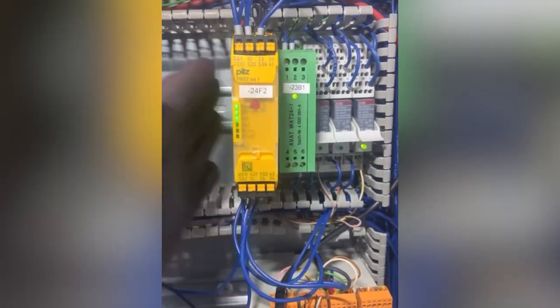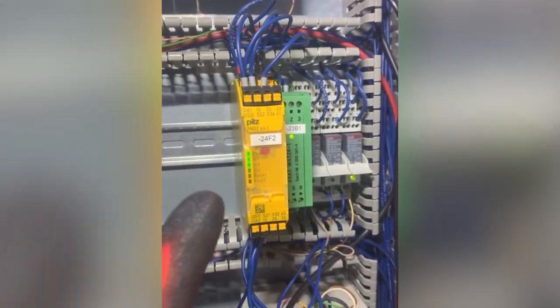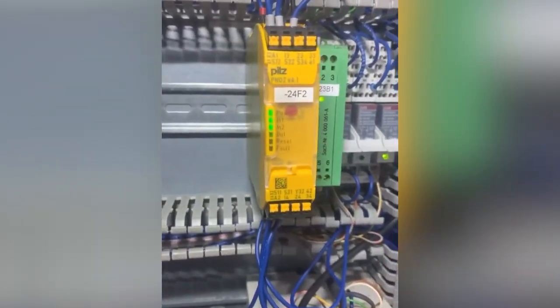So yeah, it's not always electrical. I don't like the way this wobbles either, but when I was doing that, I could get it to light. What I did was, instead of recording it on my work phone for posterity, I just checked the cables. I shouldn't have done that. I should have continued to get the fault, then checked the cables and proved it's gone away. But you can see at the minute that vibration is not affecting it, the fault light's not coming on. So all I can do now is hand it back over to them. They can run it and see if that fault light reappears. But I'm pretty sure it's just bad maintenance, it was plastic riveted. They've snapped from the vibration, it's fallen off, it's pulled the cables and unseated them. We hope.